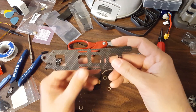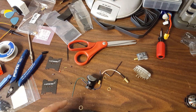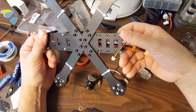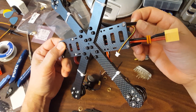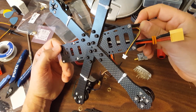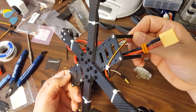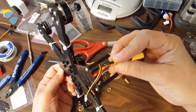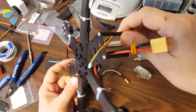This is the regular QAVR, which is the same size top plate as the QAV210. I think these 2000kV motors are going to be beasts on those DAL 50-45 bullnose props that were a little too much for my 2250kV motors on my other copter, but they'll definitely want an 1800 65C battery to feed them. I will definitely keep you informed as I complete this build.